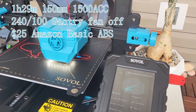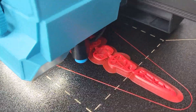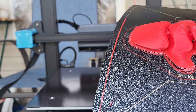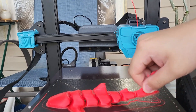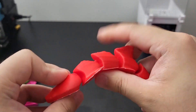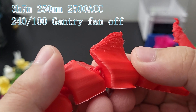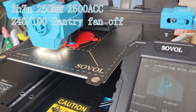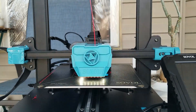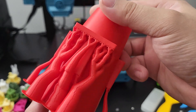I was wondering how well this printer could handle high temperature filament at higher speed, so I tested ABS. I brought the printer outside to the yard and tested with this model. I also manually turned the gantry fan off from the screen, as the extra cooling may cause layer adhesion issues. The print did finish with no issues. The part did not look good due to the major cooling issue, as you can see. I continued with a model that has less small perimeters and less overhang — this model looks good overall, with all layers sticking together fine and looking smooth.